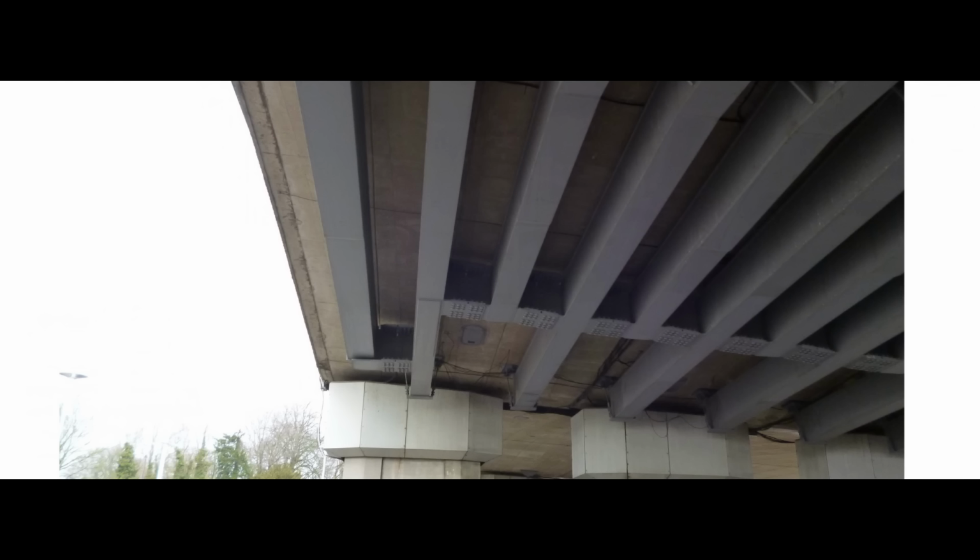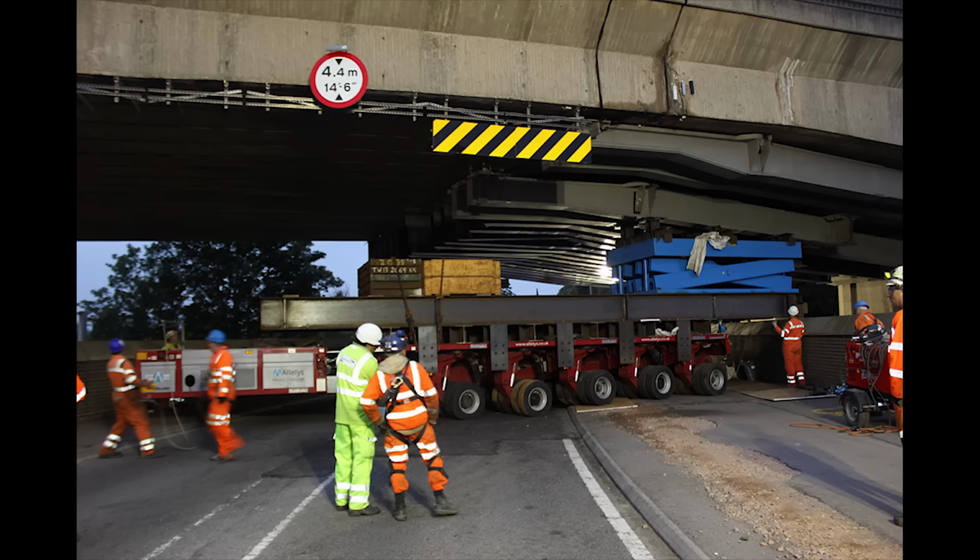I mean, I'm sure it was probably fine, but measures were taken in 2003 where steel beams were installed across the length of the bridge. These would catch the bridge should the half joints fail. Whilst the design life of this fix was 12 years, further strengthening work would be carried out in 2010 and 2013, but none of it really worked, and the council were faced with a clear choice: either get rid of it or replace it altogether.